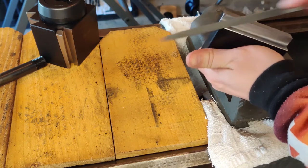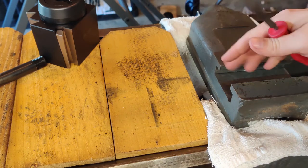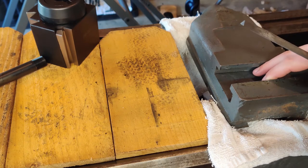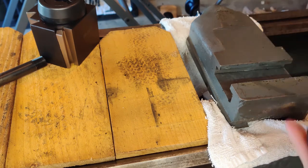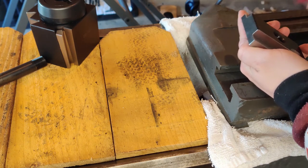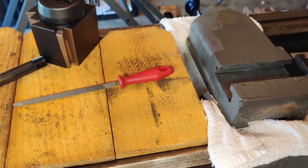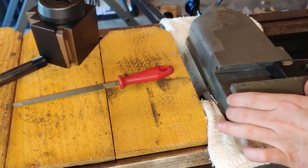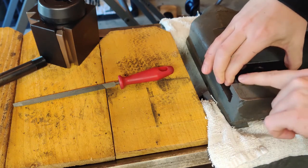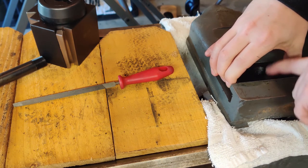So the T-slot on there has, I could measure the edges of the T-slot, like out near the ends here, and I got some good measurements there, but after I did a little bit of checking, it seems that it was tighter towards the center than towards the edges, and I don't really have a tool that could get down in there, like a telescopic gauge or anything like that. So I did cut it a little bit undersized, and the dry fitting seems to work just all right, and that puts us a few thousandths below the surface here. Actually feeling that we're probably maybe 30 thou under.